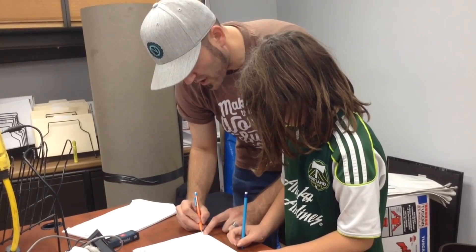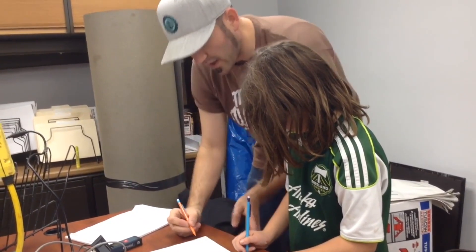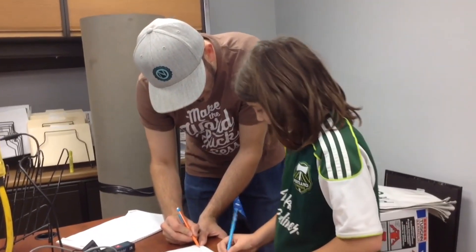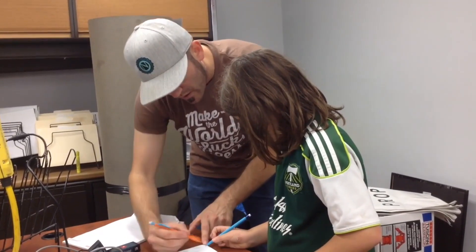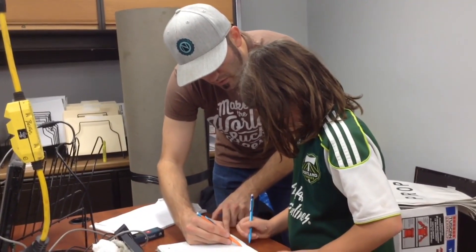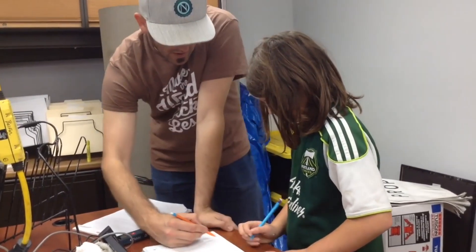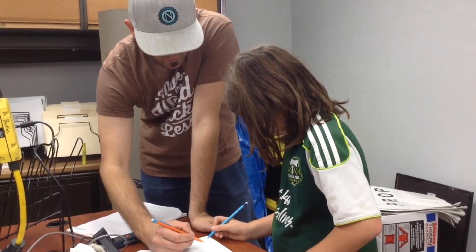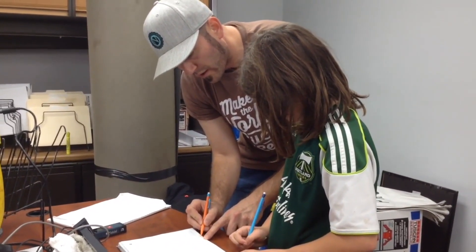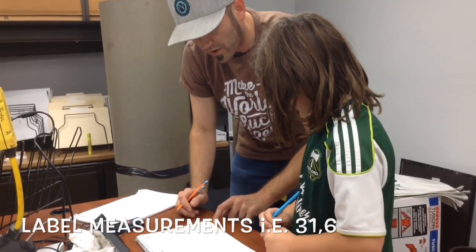If we're going 31'6", we're basically going to go to 32, so we want 16 lines basically. Do you know how to count by twos? Count by twos starting here until you get to 32: two, four, six... thirty-two. So that's our end. Draw a line as straight as you can from there to there. And then write right here 31'6", so that tells us that line is 31'6".